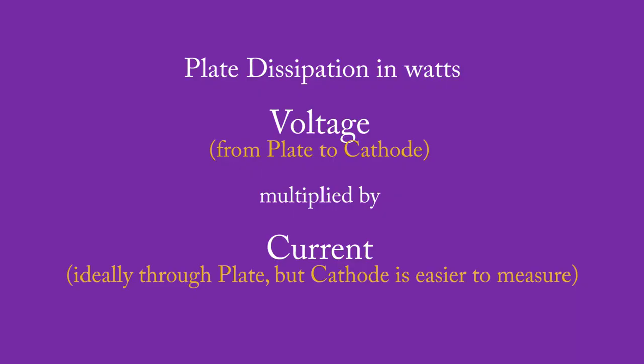This truth applies to both fixed-bias amps like the larger Fenders and Marshalls, and cathode-biased amps like Voxes and their spin-offs, some of the tweeds and smaller Fenders. Changing the B+ will most likely change the current through a tube and the dissipation — which is the voltage across the tube from plate to cathode, multiplied by the current through the tube. So if you go from a 5Y3 to a GZ34 without adjusting the bias, there is a very good chance you'll overheat or even red-plate your tube.